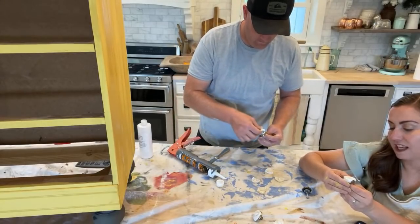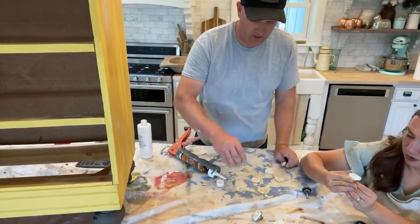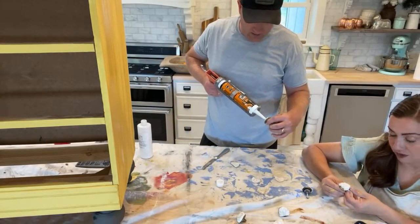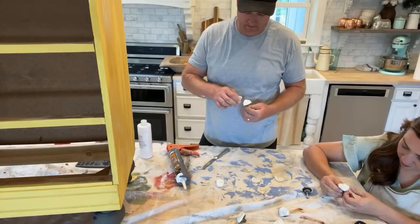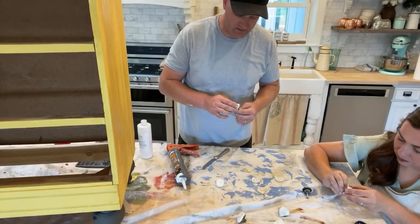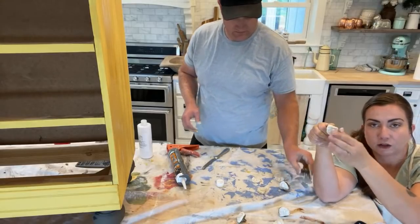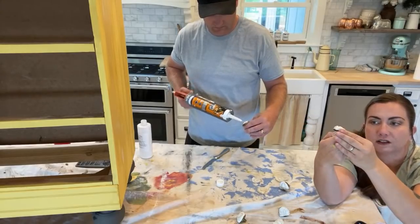This is a great way to salvage old knobs that maybe aren't that interesting but you want to reuse. Knobs are expensive — if you go get them on sale they're still like $3 to $5 each. One pack of paper clay is only $12 and you could probably get a couple sets of knobs out of it — I didn't even use an eighth of that pack to do these eight knobs. These will crack as they dry, which we love. If you didn't want cracking, use resin. Make sure you use the Gorilla Glue construction adhesive, not just traditional Gorilla Glue — Gorilla Glue expands. The construction adhesive is heavy duty, all-purpose, good indoor and outdoor, and holds in 30 seconds. That's why we use it — it's fast grab.